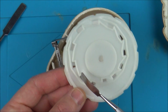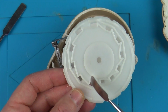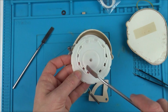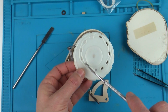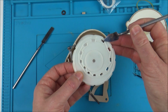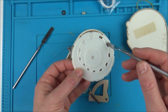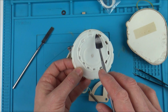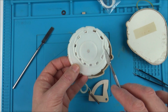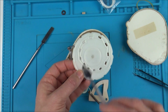And have a look here. This is just purely a clever way of making it jump to the next saying, because with this mechanism here, the way this thing works, kicking it back in at the end, it's always going to move to the next one. So can you see, this is the one on the inner one of the record, and this is the one on the outer. So for example, this would be saying number 12, 11 slightly in, 10, 9, and we're just working our way spiraling inwards. Well, no, not from there to there, because these are very similar, but can you see that each of them has got a different place in the record, because this is the middle here, working our way out. So every one of these are different grooves.